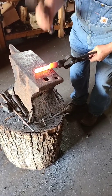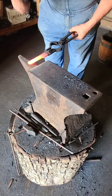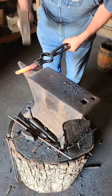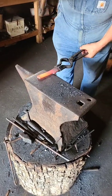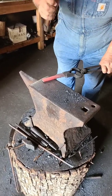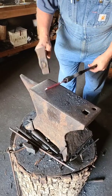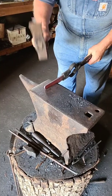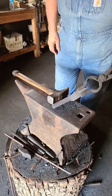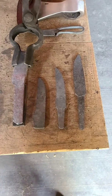So I'm turning it over and working both edges. And then we'll do a little bit of a drawing again. Again, it's a hammer pattern. Down both edges, back down this edge, down the center, and flat. Well, it's still got color, we flatten it. While it's turning dark, we smooth it. So it may be an 1/8 inch short, but let's look. Yeah, it may be a 1/4 inch short and slightly narrow.